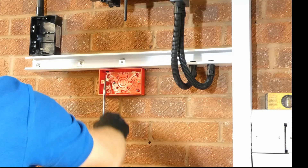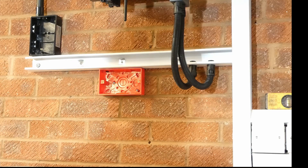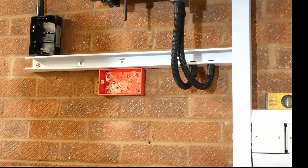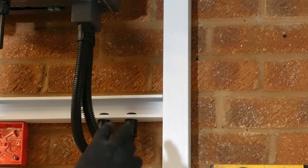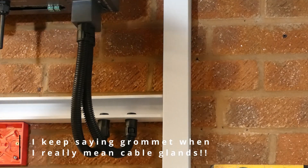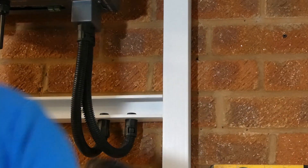Hopefully we can get through there — fantastic. And then eventually that all gets wired up and goes on there as well. One of the other things we need to do is add two grommets for earthing connections — the earthing connection on the back of this inverter, and the battery will also need one as well since it has a metal case. Let's climb up on the desk a little bit to get that done.